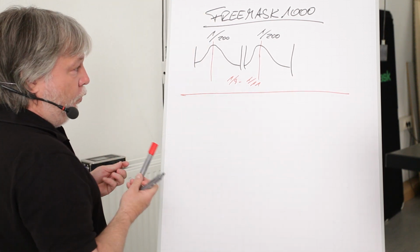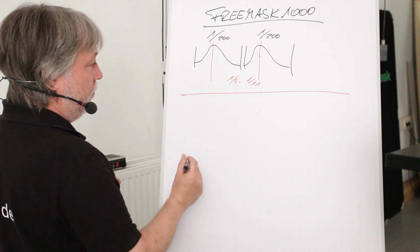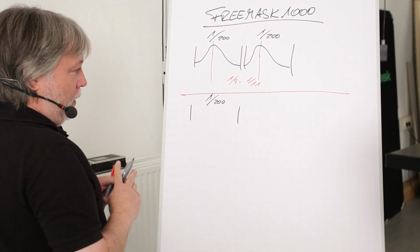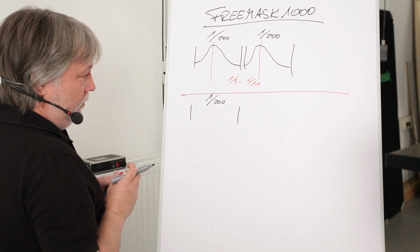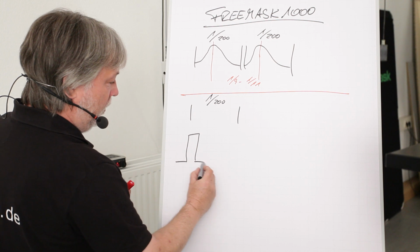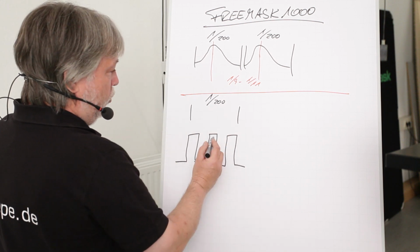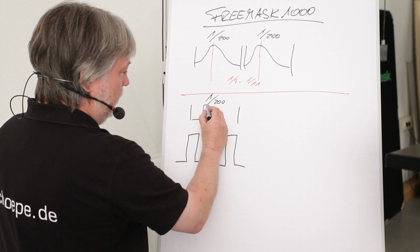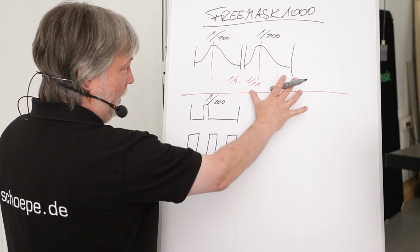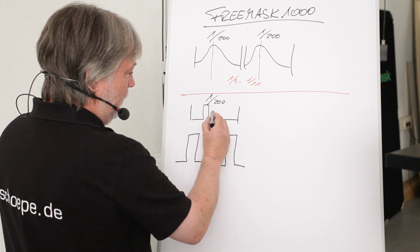Now there's new technology. Hensel Speedmax flashes use IGBT technology, and they don't have a sinus curve. Their burn rate is rectangular with very high flanks rising and falling. And we're simply using this to set the delay as short as possible in an attempt to put the falling flank of the subject flash and the rising flank of the background flash as close to each other as possible.